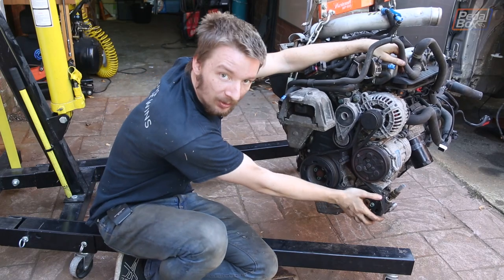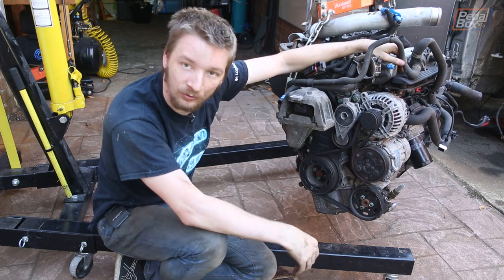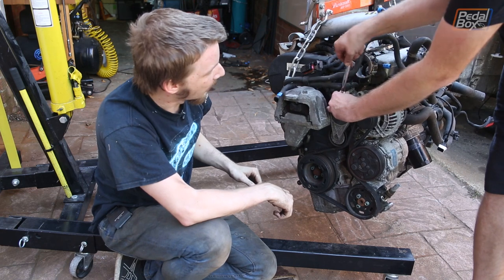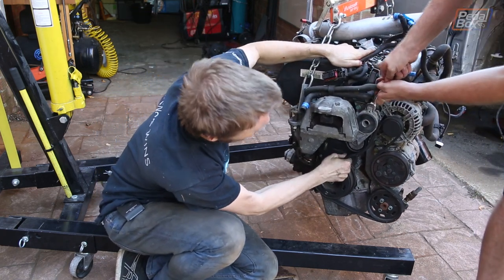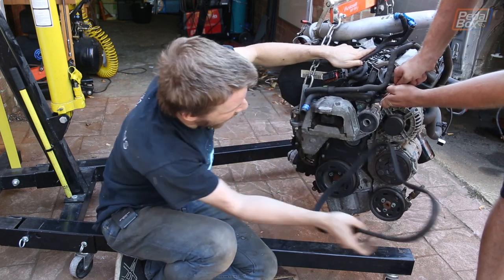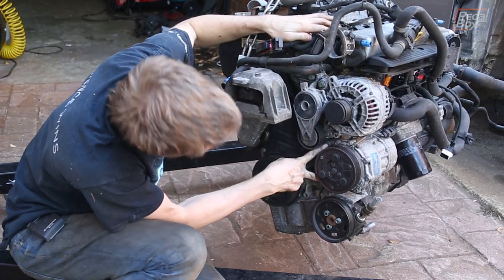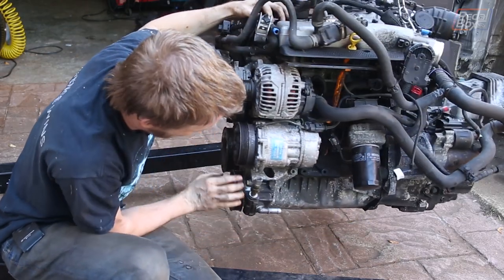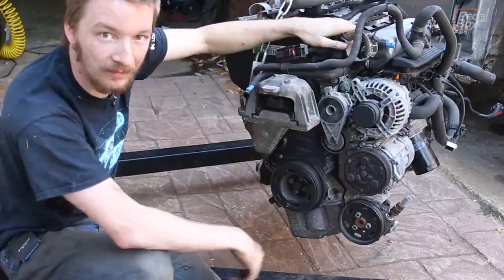The power steering pump and air conditioning compressor that we're using neither of need to go. So step one, we release the tensioner, which is a spanner on the top, and wind that back, he says. And now we can pop the belt off, and now we can get into more of our bolts. The air conditioner compressor has 2 bolts here that are blocked by the belt normally, and the power steering pump is held on by a couple of bolts that are blocked by the pulley. So we'll pop the pulley off, get these 2 gone, and we're all good.